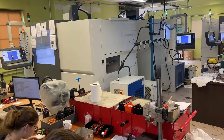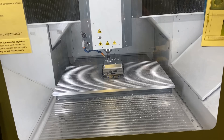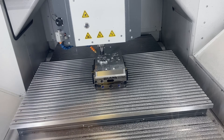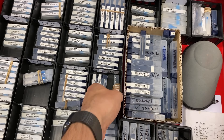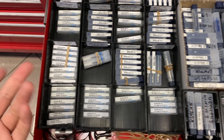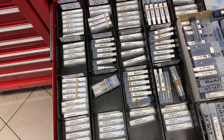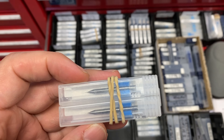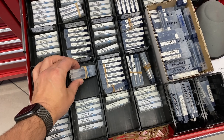That's part of our CNC park. We have one, two, three, four, five, six, and here is the seventh CNC machine. That's how the machines operate. We have an aluminum block there on the machine and the cutter. We obviously programmed the cutter to do the work. Currently it's doing a rough cut, so the tool is quite large. We have large tools, small tools, finishing tools, and usually we start with 6mm tools and go down to 0.3mm — we have also 0.2mm. Just to show you how small they are — this is how small they are. Each of these tools costs around 100 to 200 euros, and we use about 3 to 4 every time when we make a plastic injection block.